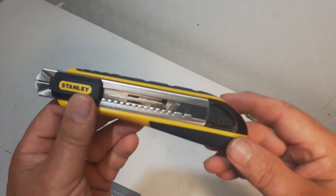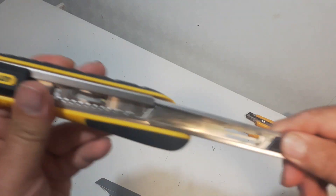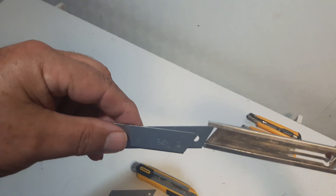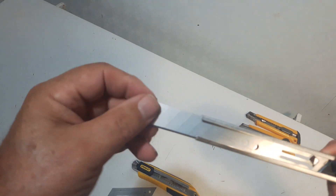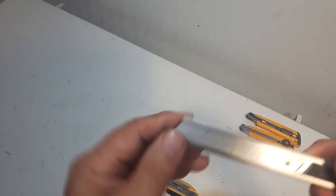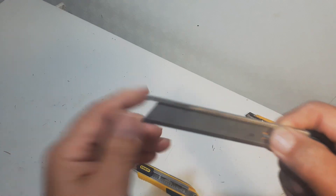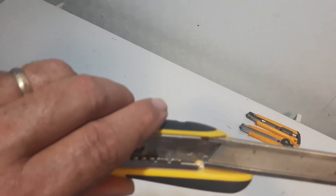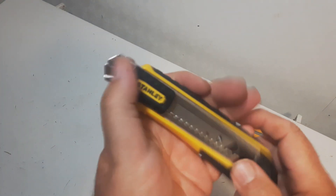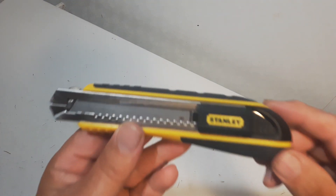Now, I was trying to figure out how to get a blade in here. It actually is the chamber — you press this and you slide, so that slides out here, and then you put your blades in here. Make sure your blades are all the way down, past that little piece that pushes them up. Now you slide it back into the knife itself, pull it back. There you go — that's how you change the blades in the Stanley.